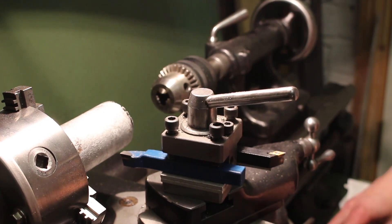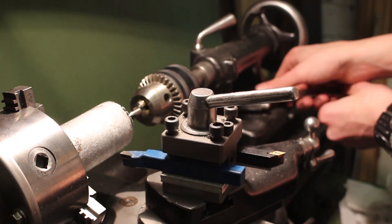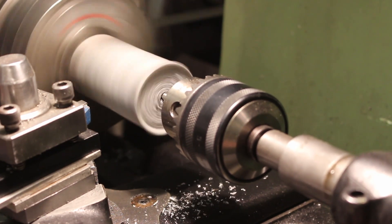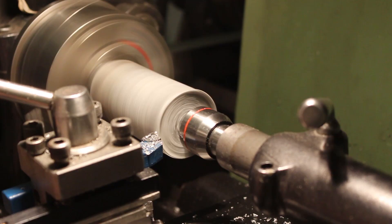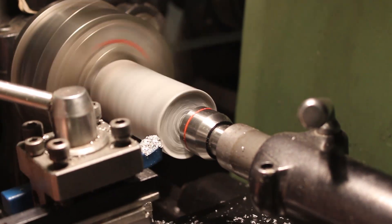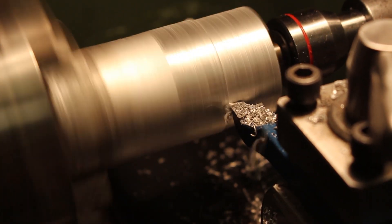The turning on this project is pretty much as simple as it gets — you just face it and then turn down the edges until you get to smooth metal on the inside. I like to give mine tailstock support even on a short piece like this, just because my chuck jaws aren't very long. I find that you only have to take off about 1mm from either side until it becomes completely smooth metal.